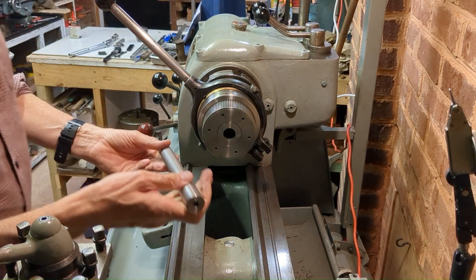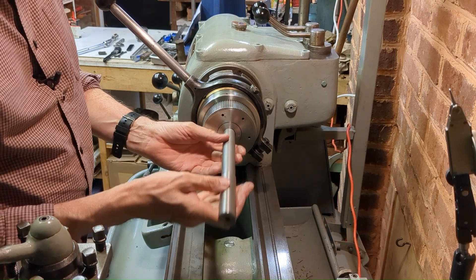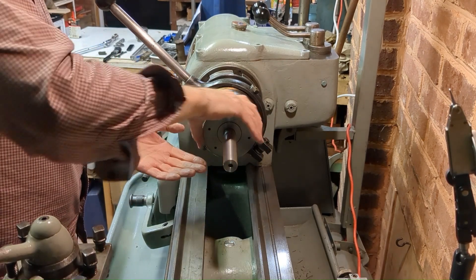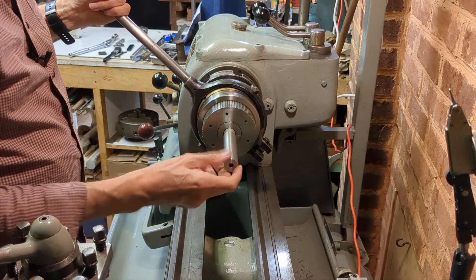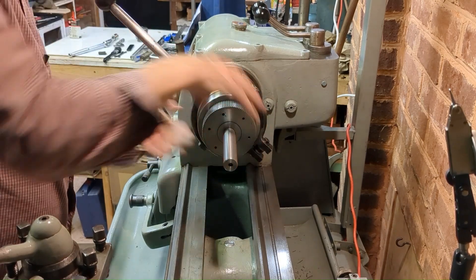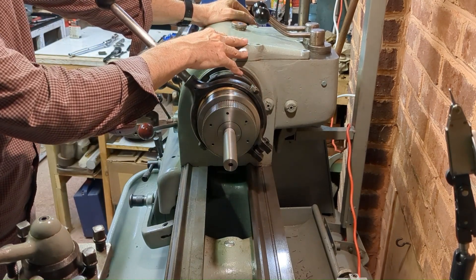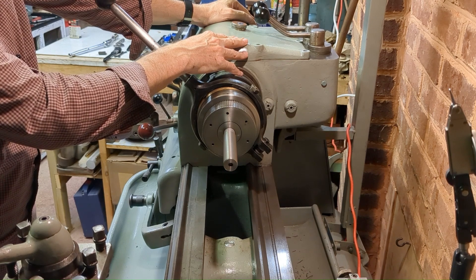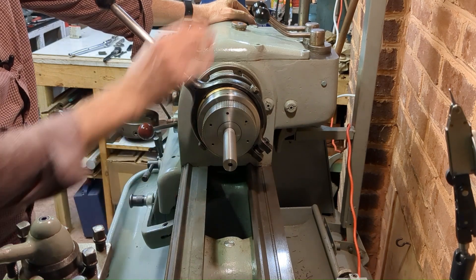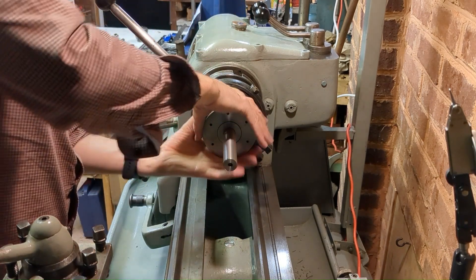I've made a little test bar within the range of this collet. I made it using my four-jaw chuck, fixed steady, and centre, and I turned it up nice and parallel — which is interesting, because I set the headstock up in Pakistan before shipment, probably 18 months to two years ago, lined it up with the bed, and re-levelled the bed here. I was surprised to discover that everything still lines up, so I was really happy about that.